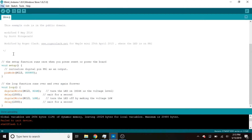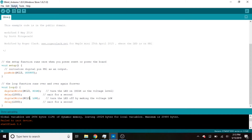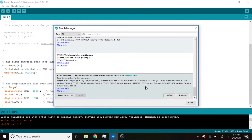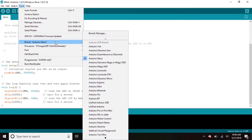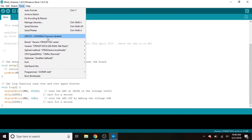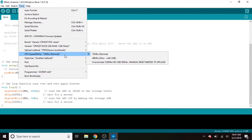In terms of setting this up with Arduino, go into Preferences in the Arduino IDE and add the provided link to the additional board manager URLs. Once that's done, go to Tools, then Board, then Boards Manager, scroll down, and install the STM32 boards package. Now under Tools and Board, select the generic STM32F103C series, change the settings to 20K of RAM and 128K of flash. The upload method should be the STM32duino bootloader — which is what we just installed. CPU speed and optimization can be left at their defaults of 72 MHz and smallest.